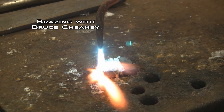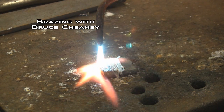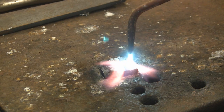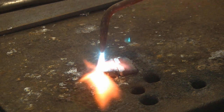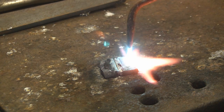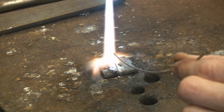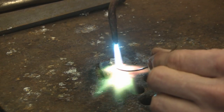The Harris products are really good for soldering, and I highly recommend them. I've used Harris silver solder for over 30 years, and it does what I need it to do. I'm getting some heat built up on my piece, and now I can kind of go towards the center. One thing to keep in mind is not to burn your flux up — if it turns black it will not be effective. Right now I think I'm about ready. I'm going to start on this side. In the middle it's a dull red, and I can tell it's ready to flow.